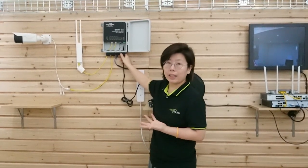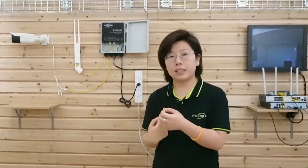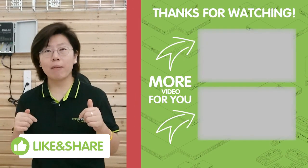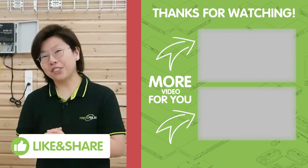Since our customer has to install most of his equipment outdoors, he needs to select appropriate CCTV network equipment — outdoor PoE switch, outdoor access point, and outdoor cameras. Also, be careful with installation: don't use your hand to fasten the cable gland — use a wrench. Tightening with a wrench compresses the rubber inside, preventing water, moisture, or small ants from getting into the enclosure through the cable. Always leave room for future expansion by having additional ports on the switch so you can add devices later. Thank you for watching — please subscribe and share with a friend who can benefit from it!